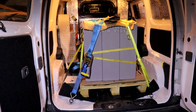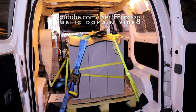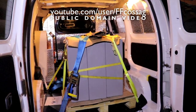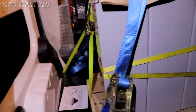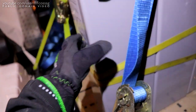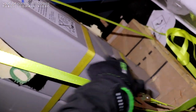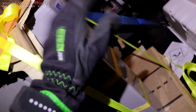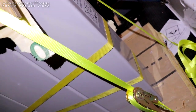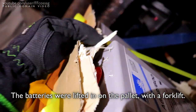We have the final batch of cells and I'm just about to unload them. I thought I'd show you how I go about packing and loading these. The cells are a bit difficult to move since they are so prone to falling over. I've done them in groups of 6 and 12 — this is the final six — and I've wrapped a ratchet strap around them in two levels to give them two hugging points so they are unlikely to scissor and move independently.